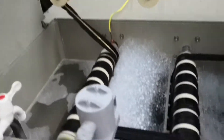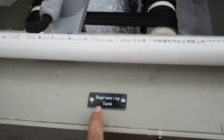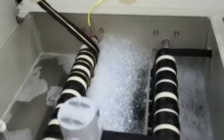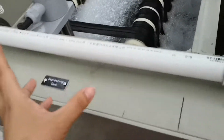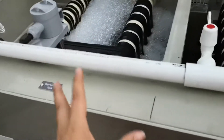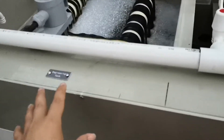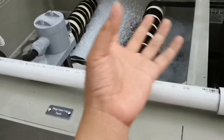The zipper goes through inside very quickly. This is the first oil degreasing tank. The zipper will do the oil degreasing inside this tank. However, if the zipper has already gone through shining gold plating, then there is no need to put the oil degreasing or oil removing powder inside.